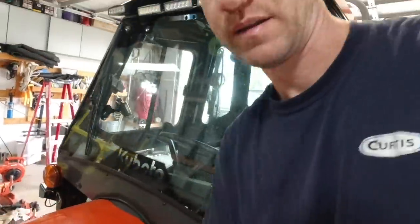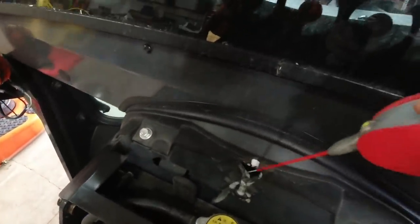There we go, she's purring like a kitten. Hey guys, here's a little tip: if you've got an 80-series and you've got this hood latch — mine's stuck way under there because of the cab, but I can still get to it — put some WD-40 on there, otherwise it's going to be a bugger because those tend to stick. Get right in there with a little WD-40 and that will save you a lot of trouble down the road. With the limited space from that cab, I really struggled getting the hood open a few weeks prior when checking the oil.